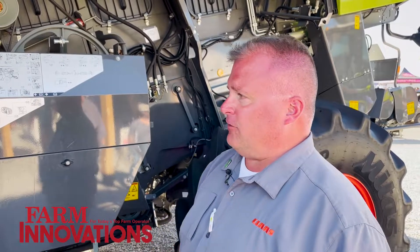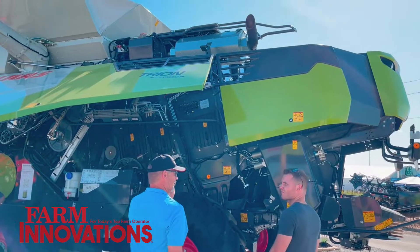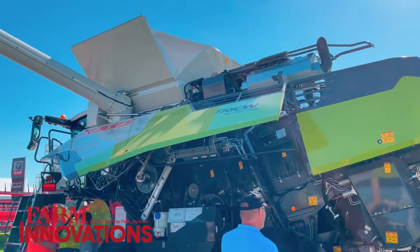What's really different about this combine is on the inside — this combine has a single rotor versus the dual separation rotors used on the Lexion. So that's another reason why it's a lot simpler; we're not driving two rotors, we're only driving one. Its threshing system is still the same APS system that we used on the Lexion 740. Really the inside of this combine is nothing more than a Lexion 740, just with one rotor instead of two.